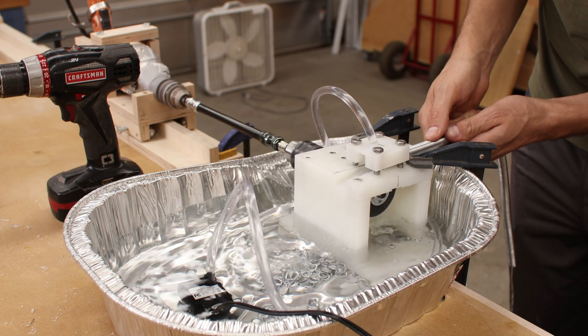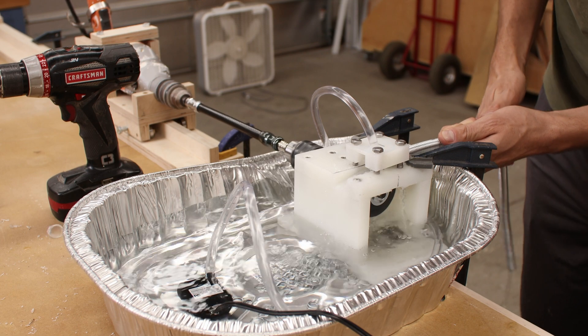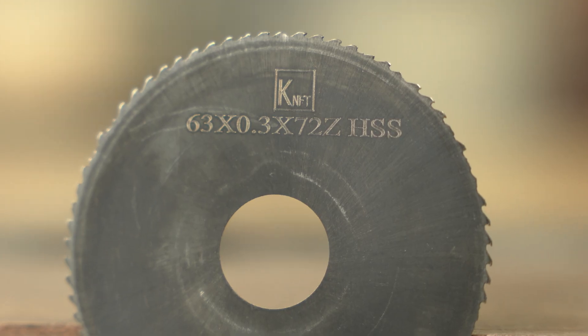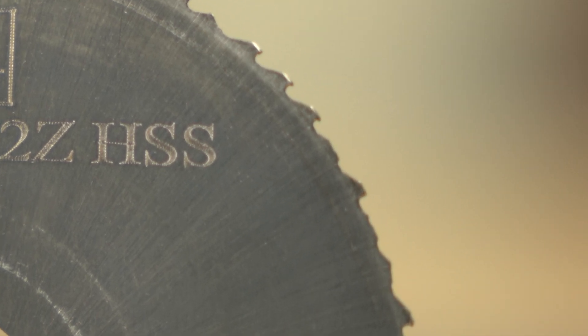I had also put the coolant so it was facing towards me, and I think what happened is that the coolant wasn't on the blade long enough so the blade was getting too hot, and also it was getting me all wet. My blades are also too small or too thin. Once I moved up to 14-gauge steel they were fine with the thinner steel, and I was running them too fast — I knew that — but I was getting better cutting when they were running fast, but then that made them get too hot and chip out the blades.